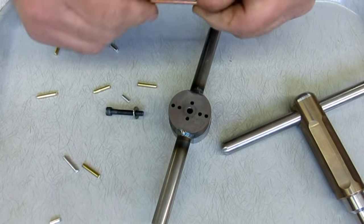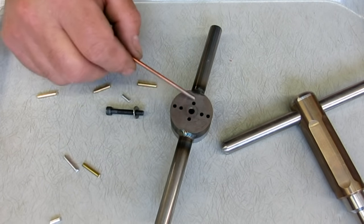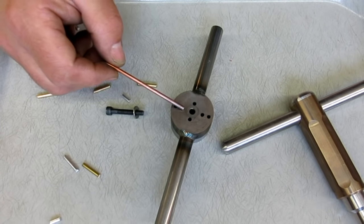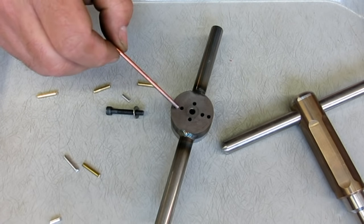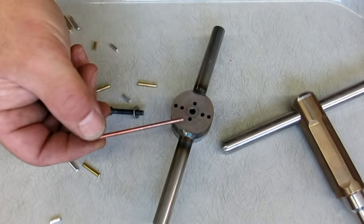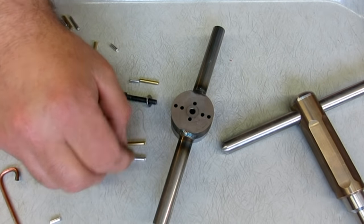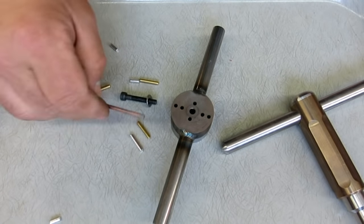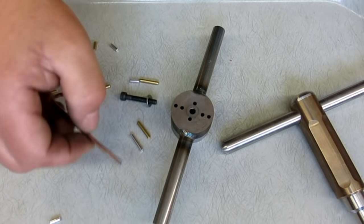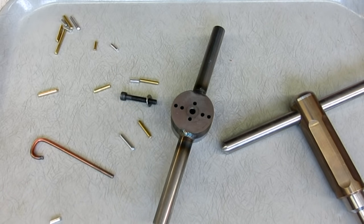So what's going on here is this is me trying to determine what that radius was, okay? So we're pivoting about this center here. And the farther the shear pins are from the center, the more handle torque it's going to take to actually shear the pins. Also the material of the pin has an effect on this too. The stronger the material, the tougher it is to shear. Now this is steel, this is brass, and then this is aluminum here. These are some of the materials that I tested.